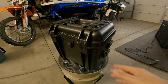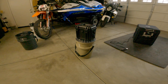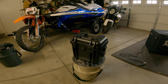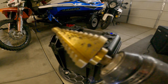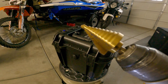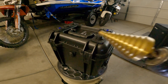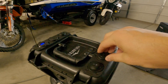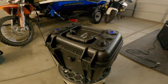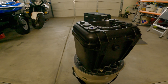Still a good box. All together, without the rock lights since those were extras, everything cost about $150 — not a bad deal when the Goal Zero 400 is much more than that. Also, this drill bit was perfect — it's a 1-and-3/8 inch step-down bit. I used this entire bit all the way down and it creates a perfect hole for the outlets to go into, then you screw them on from the back.